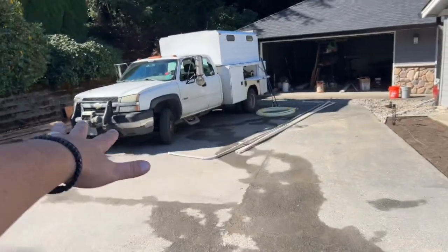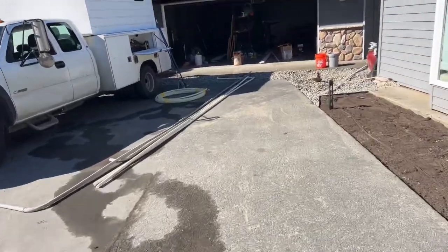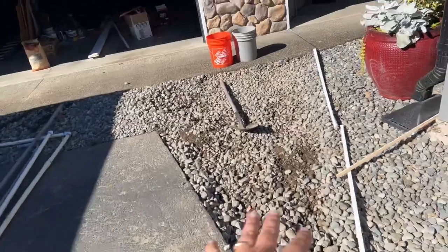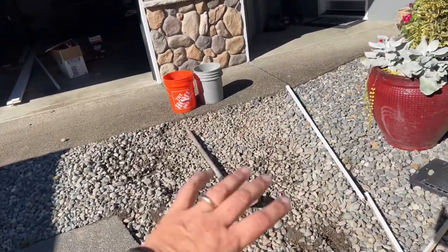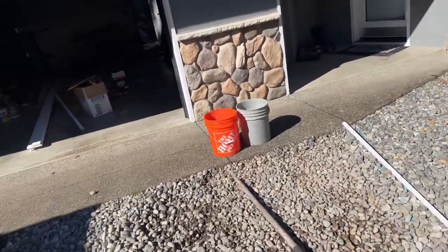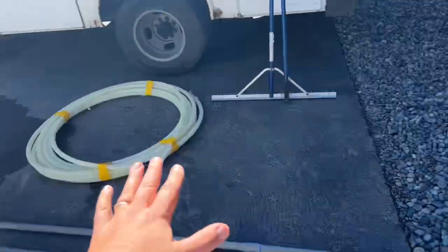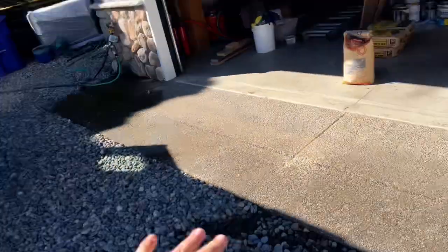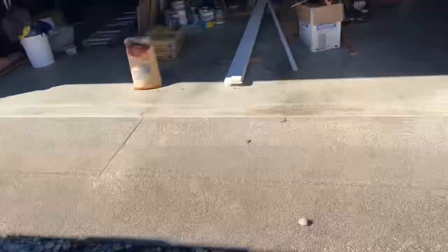All of this will go down and be paved. We're going to pave right through here, so they'll have the rock removed — we only need a couple inches. You'll have 2 inches on top of this existing asphalt, and then 2 inches of this rock will be taken out. This is where we'll be able to transition down to the concrete.